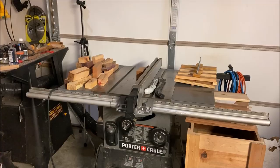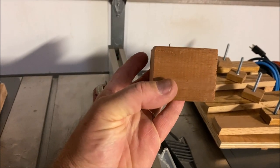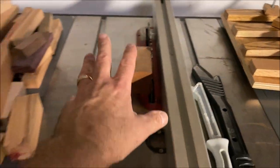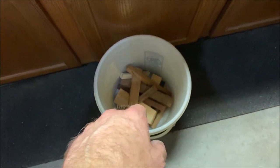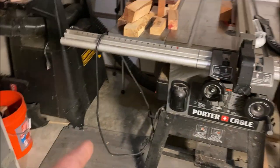I'm going to get busy on prepping for the chaos blanks. I need to find out what time it is because you can see it's getting a little dark outside. I've got the table saw completely set up. This is the tallest blank that I have and you can see the grain runs left to right. So I'm going to split it in half to three-quarter inch, then cut the other piece down to three-quarter inch, run it through and knock off some little pieces that I'll glue together. This is some of the larger stock that I'm going to reduce. That took most of the stuff out of the bucket — there's a few things in there that are just too skinny, or some of it is from flooring so it's got the tenon in it. I have this box and this box that need to go, but I want to get the big stock ripped down first. I'm all set up and ready to go — all I've got to do is plug the saw in and start ripping.